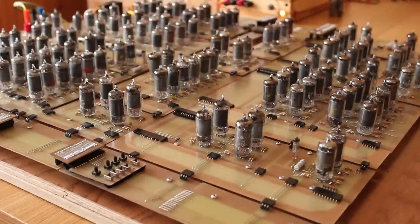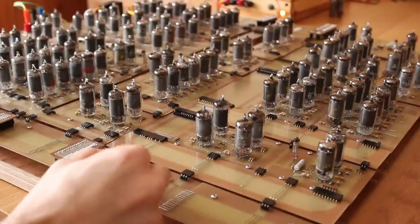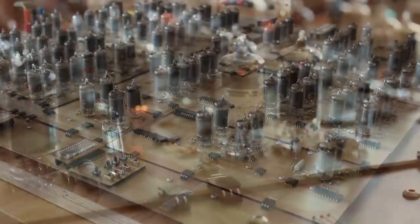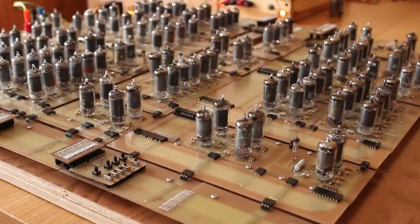That is awesome. And then the final step for initialization is that I want to clear out the result register, so I just do a load instruction, which is 0001, set the data to 0, clock that in, and there we go. So now the result register is storing a 0, the carry register is storing a 0, and our input enable register is on.